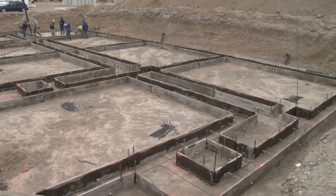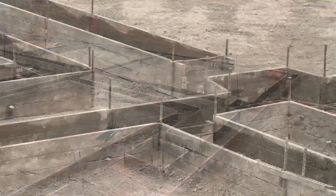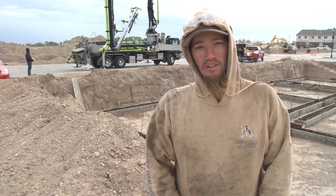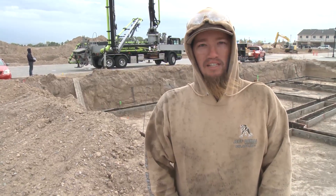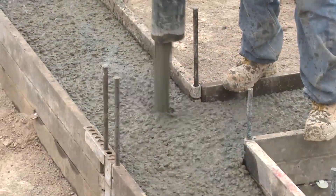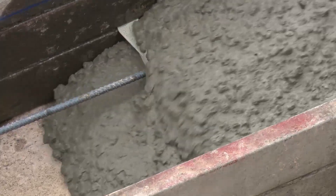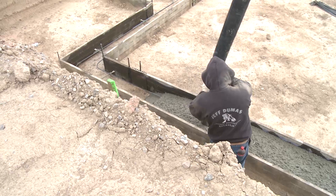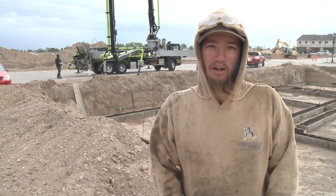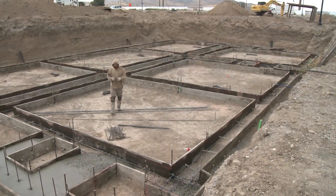This is a fourplex — it is 710 feet of footing. I got here at 8 o'clock this morning, started laying out, and it took me three hours to get this thing 100% ready to go. If I was using lumber, I'm looking at probably another hour and a half at least to get this ready — I've just saved myself an hour and a half in payroll and time. I can now squeeze in another footing if I need to. With wood, I'd be looking at about a four and a half, maybe five hour prep time. I'll also save myself time in the morning — I'll be stripped and ready to go to the next job in about 45 minutes. With lumber, I'd be looking at probably an hour and a half strip time.